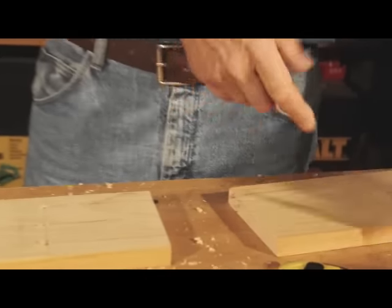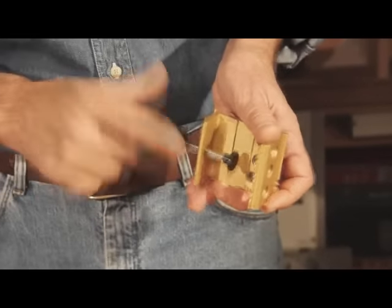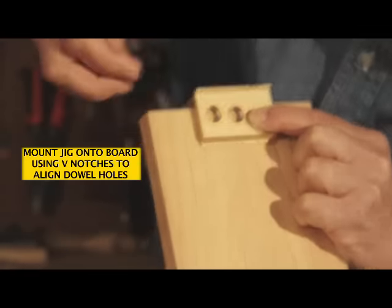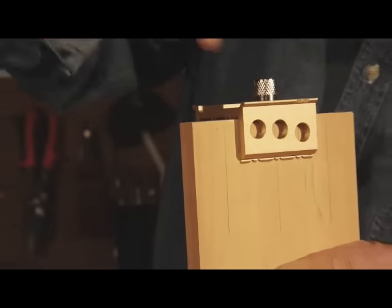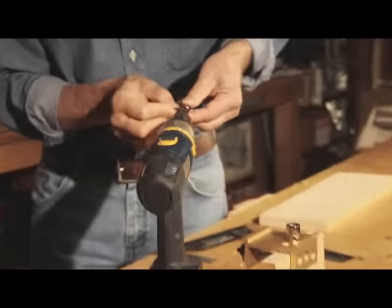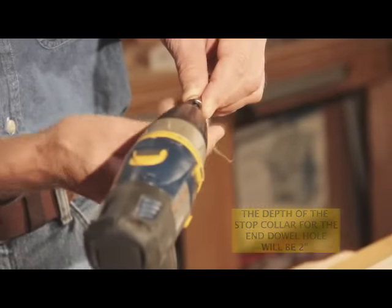Remove the guide bushing from the inside position. Run the thumb screw down so we can clamp it to the wood. And we position, as we did before, the guide with the V-notch on the center. Tighten the clamp — jig is now secure on the board. We're going back to the middle hole, which is for three quarter inch stock, and we'll bore each of these holes for the end dowels. We have to reset the depth of our stop collar to two inches, which accounts for the thickness of the guide bushing on the jig.